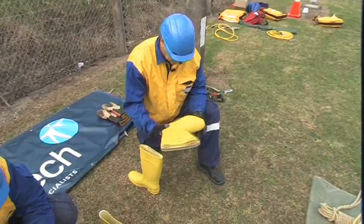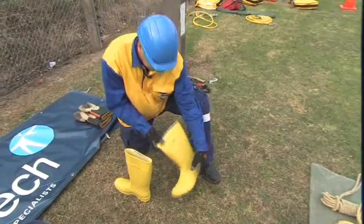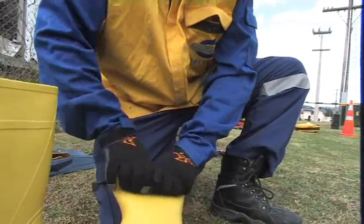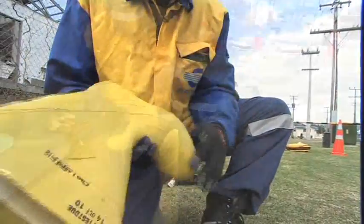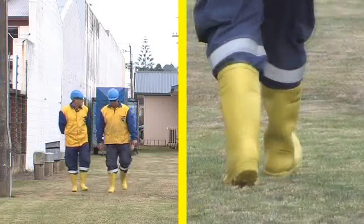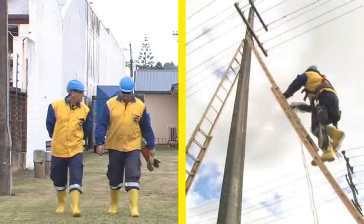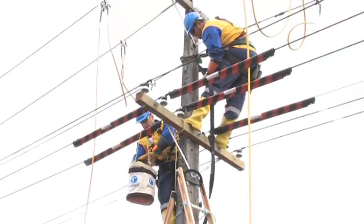Dielectric boots are like rubber gloves and should be treated in the same manner. They must be electrically tested every six months, stored in their own bag, and field tested before every use. We'll do a visual inspection first — make sure there are no cuts or splits, exactly as you do with a glove. These particular boots can also undergo a field roll test to check their integrity; they have a test date and voltage rating stamped on them. After the field test, the boots must be worn for the total duration of the outage. Dielectric boots give the worker complete freedom of movement around the site, providing isolation from any step potential, and aloft they help prevent contact between the worker and the pole, protecting the worker from a potential voltage difference.